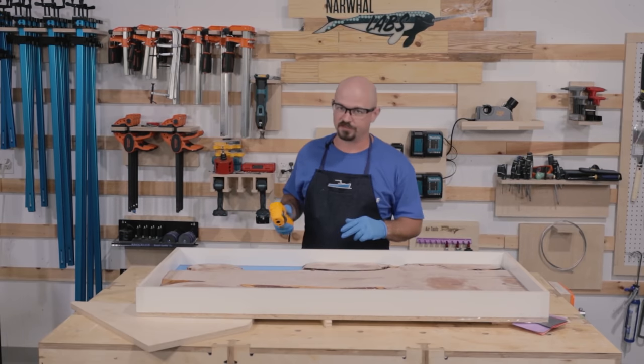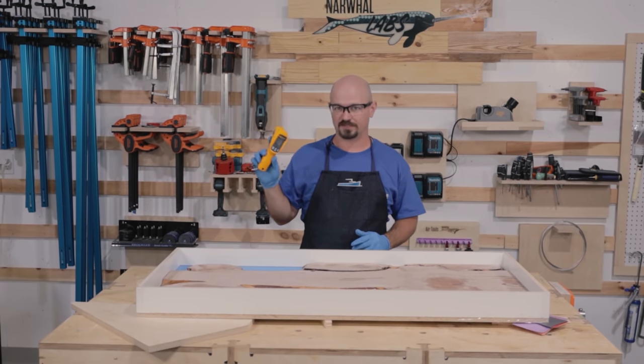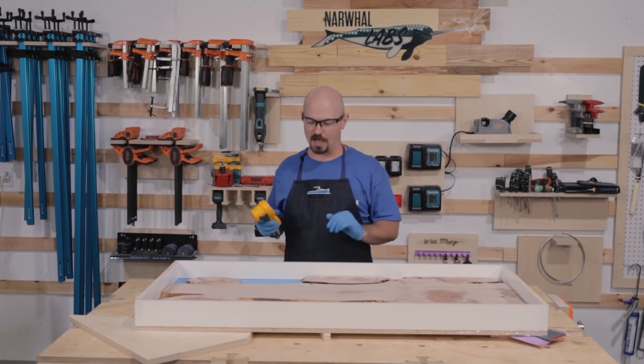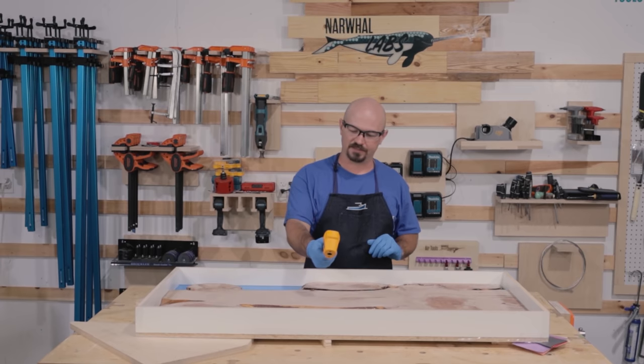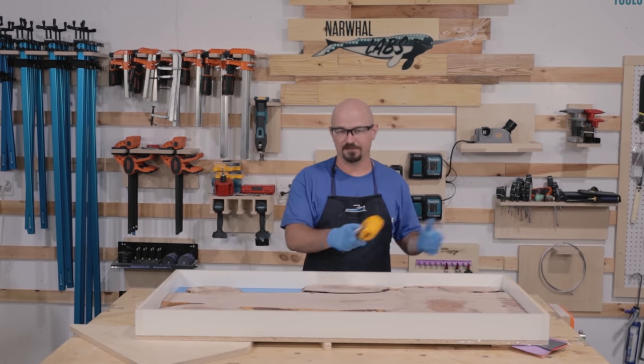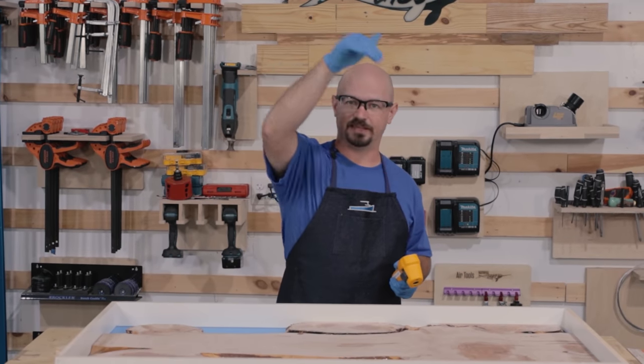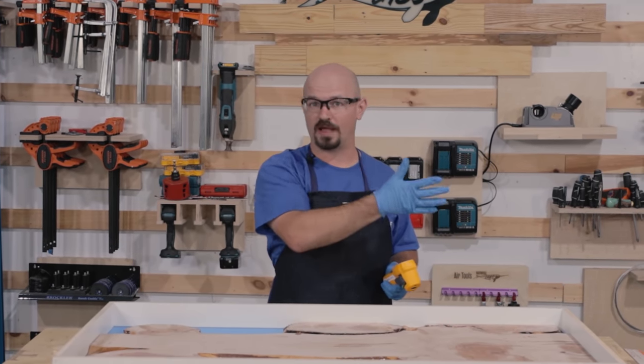Now, we know it's ready for the next pour because we've been monitoring the temperature of it. It peaked at about 106 degrees around 2 hours ago or so. We've been checking it and it's dropped to 95. Now, when epoxy cures, it does kind of have a peak. Once it hits that peak and it crests and it starts coming back down, it won't go back up